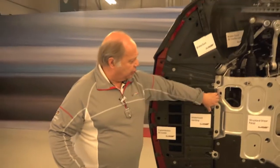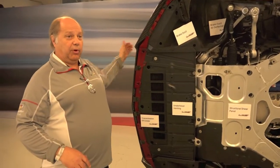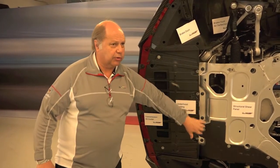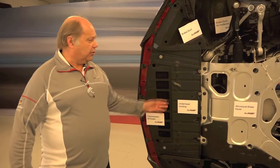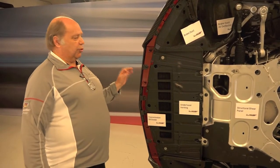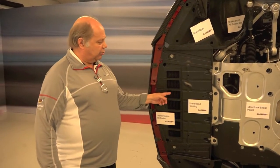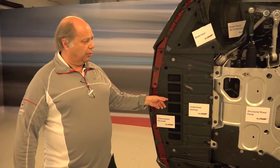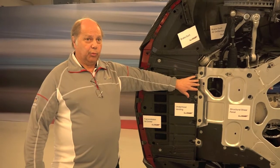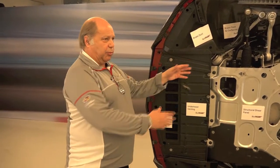Looking at some of the detail work, you'll notice that to allow air to escape, we've got a vent on the top of the hood which allows some air to come out, but then you've got to balance it with air coming out through the bottom. These carefully designed louvers are designed so that we end up getting the right pressure drop and the right flow to get just the right amount of air through the transmission oil cooler.